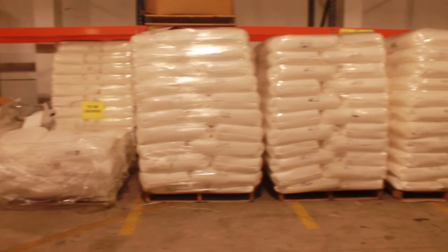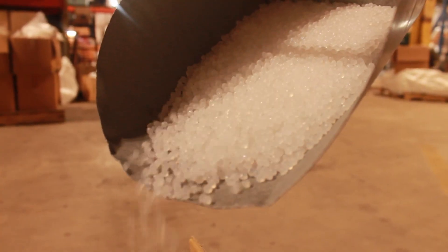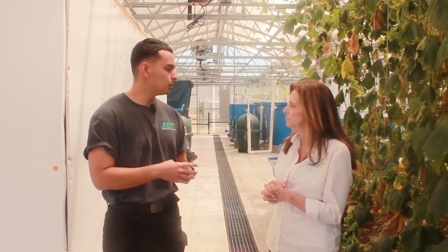So what are the benefits of these beads for anybody in aquaculture or wastewater? Mainly, they don't need to be replaced whatsoever. They also produce better solid capture compared to some of our competitors, and they also have minimum water loss — around one to ten percent compared to something like a sand filter, for example.